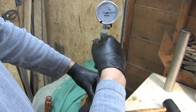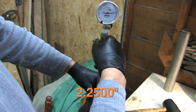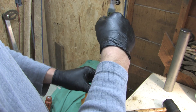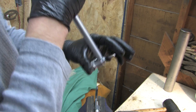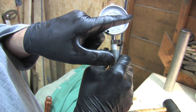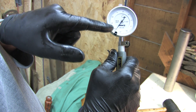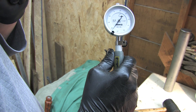You get the outer dial set up at the widest part of the sweep — that's 0 to 250. We're going to take a measurement that's smaller than that, but we have the tool set up for 2.250. As we measure the bore, the needle will rotate around past 2.250 and give us how much we need to take off of that value, and that tells us what the bore diameter is.